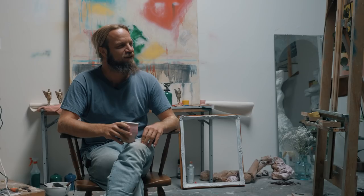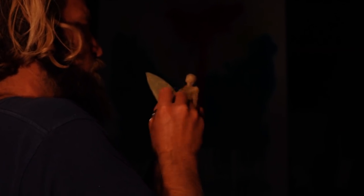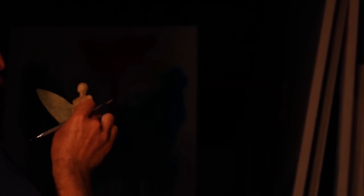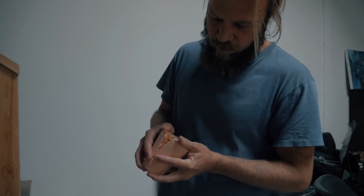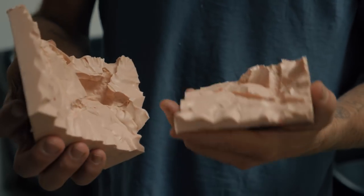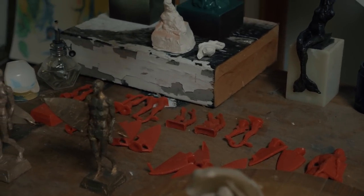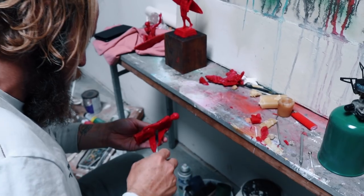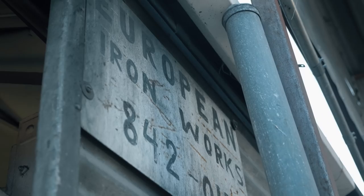Or spray the metal on. It's a really old traditional technique. You start out by making the original sculpture out of beeswax, then make what's called a mother mold — silicone reinforced with an exoskeleton. We cut the original sculpture into pieces, and around each of those wax sculptures we create a ceramic high-heat mold.